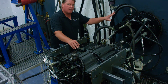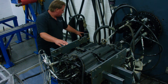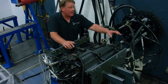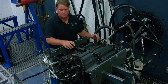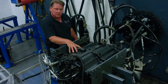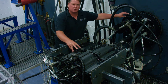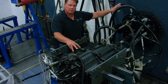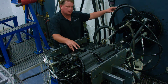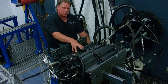Once the oil leaves the charging pump it goes through a five and then a three micron oil filter. Then it passes through a flow meter and goes back into the transmission through the pressure regulating valve. The pressure regulating valve creates the system pressure used to engage the clutches inside the transmission. The oil not used to engage clutches is then sent to the torque converter to fill it. As the oil flows through the torque converter, it goes through the oil cooler bolted on the front of the engine.